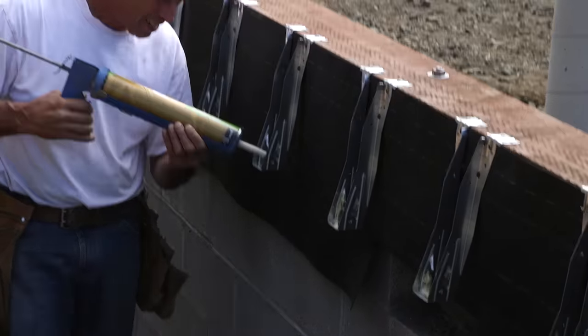The best squeak insurance is glue. The glue that we put in the bottom of the hangers, the glue under the blocks, the glue between the decking and the tops of the joist. Squeak insurance comes in a tube and comes out of a caulking gun. The more, the merrier.